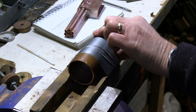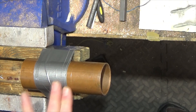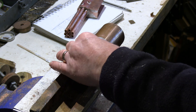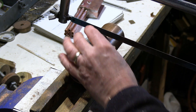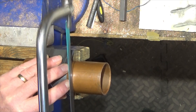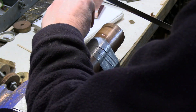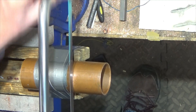One of the trickiest things with copper — especially copper tube — is being able to hold it without pinching or distorting it. Once it gets distorted or bent, it's quite a nuisance to straighten out again. I found that a tube held in with some duct tape in this little holder works quite well — crude but effective. So I'll gently start to cut round this pipe, leaving plenty of material to trim off, taking it very steady and keeping an eye on where the cut is going.